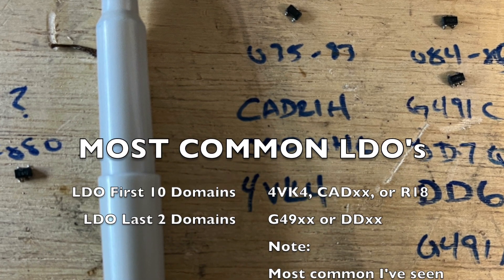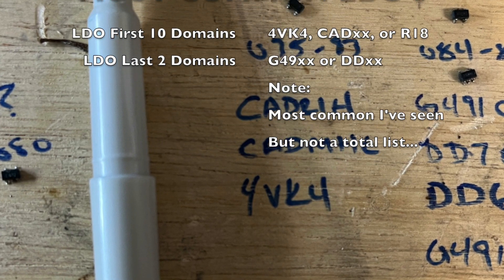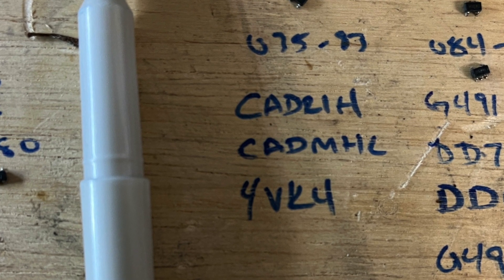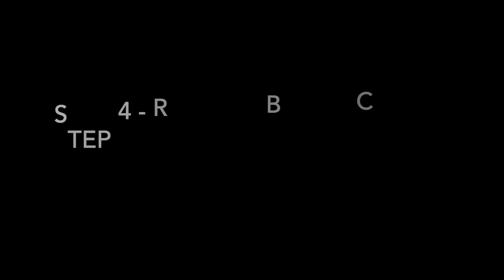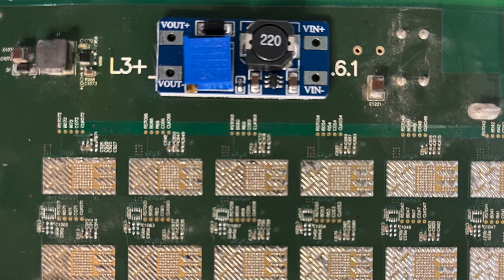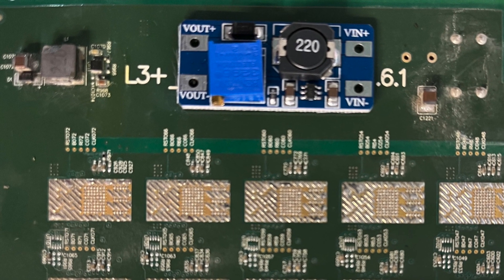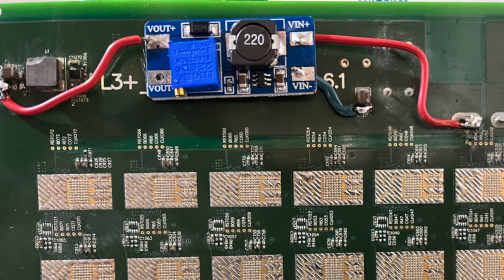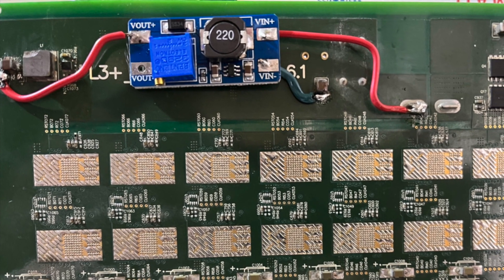After failing with the LDO replacement, it made me think: what if I wasn't getting a good clean 14V and wasn't able to source enough current into the LDOs? That led me to my next step — changing out to an external boost controller. To replace the boost circuit, we simply take this external boost controller bought on Amazon, wire it into the output of our buck controller, then remove D1 and wire into the anode of D1. I do have another video specifically on how to do this.